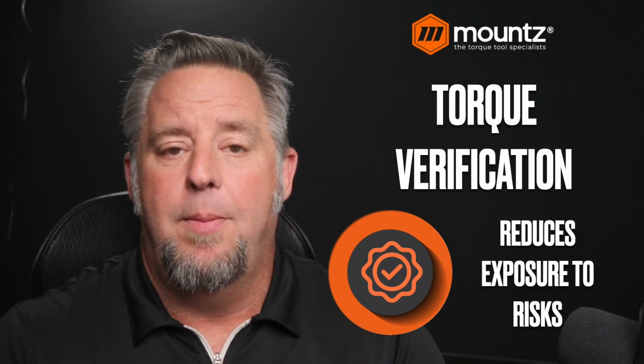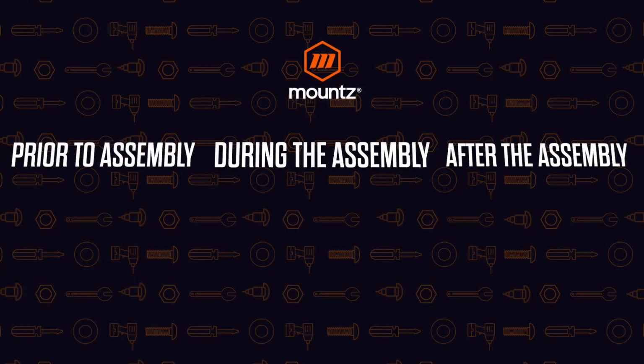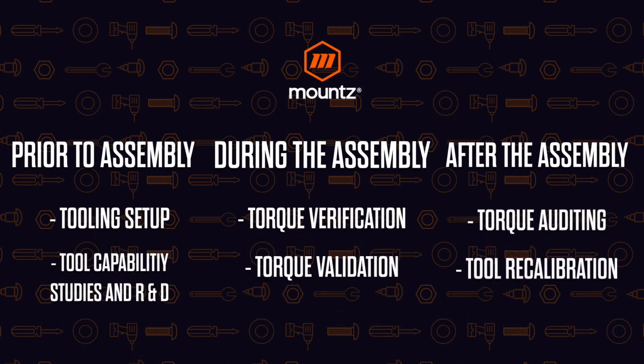So there are other facets of the manufacturing process that we can use the testing for. We can use it prior to the assembly for setting up the tool. We can use it for any type of R&D type of capability studies that we might want to do. So it'd be kind of prior to the assembly. During the assembly, we just talked about the torque verification and the torque validation process. And then we can also use them again for after the assembly if we want to do some torque auditing or recalibration of those particular tools. So these are different areas which we can use the sensor as well.